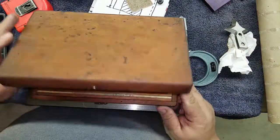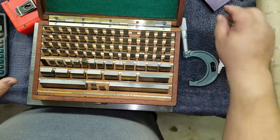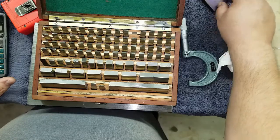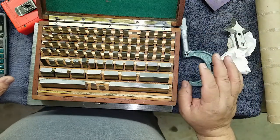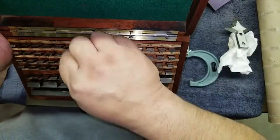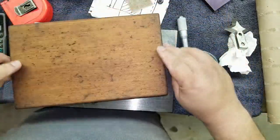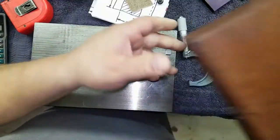Okay, here we've got a set of gauge blocks. Like I said, each wall thickness on that pocket is going to be 110 thou, so let's locate the 110 thou gauge block. There we go — set these off to the side.